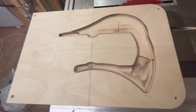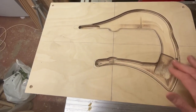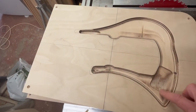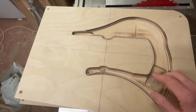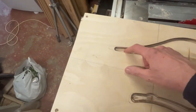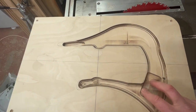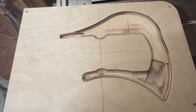Okay, so this is the front. And I've hollowed it out, reduced weight, and like I said, making a semi-hollow body type of affair. And then I cut these down. That's 11mm from this surface, so that leaves me 4mm there and 4mm in there. That's for the switch, and obviously this for the volume and tone pots, which I'd forgotten about. I had not made any allowance for those.